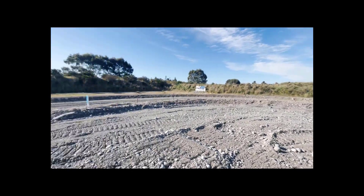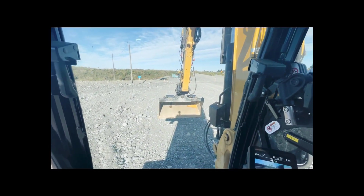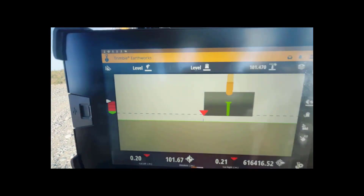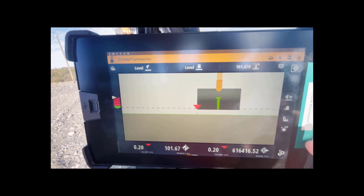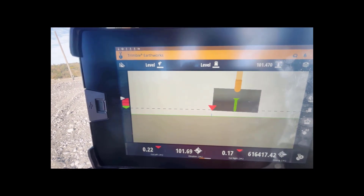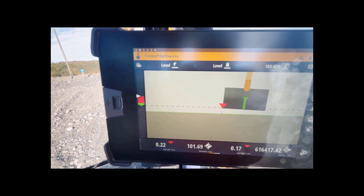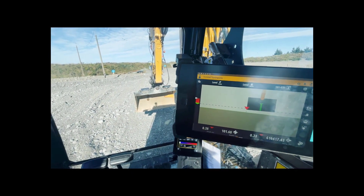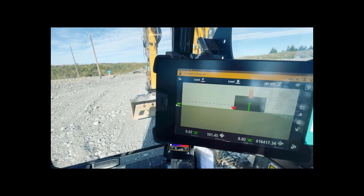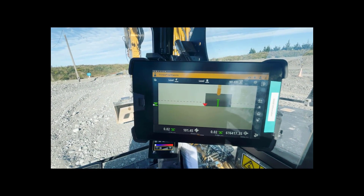We're over in the area of the floor pad - that's where we were on the curb over there when we benched. We're now out where the floor pad is on the plan and ready to get working. I've straightened my boom up, so I need to select the right swing boom position. Just have a look at the cut fills and how they adjust a little bit - getting the correct boom position is important before I dig to make sure I'm getting the right guidance. And now I'm on grade and ready to start prepping that area.